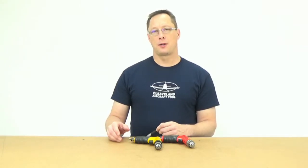We've been including number 30 and 40 reamers in our builder's kits for years, probably more than a decade now. That's because the reamer is really the right tool to enlarge a hole in thin material — in any material, but in thin material especially — where you get the triangular tear-out from a drill bit. So the reamers are designed to run slow.